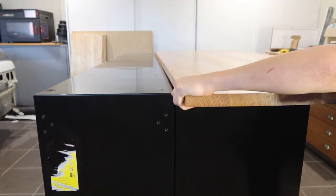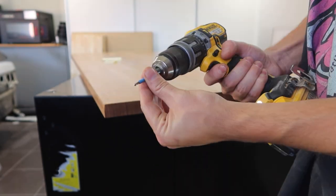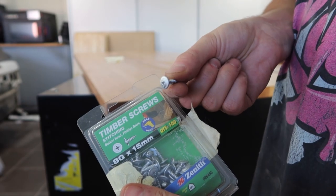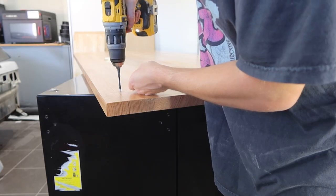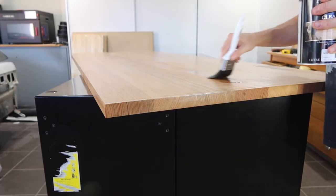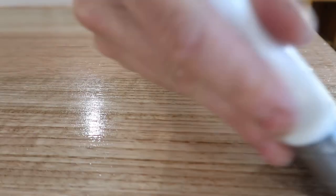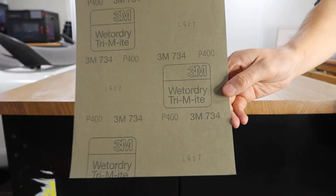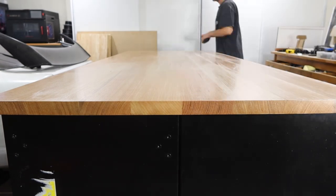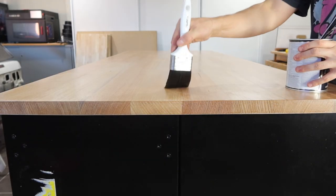Before the very final coat on the top I flipped it over to the underside and marked out where I was going to put all the screws. I decided I'd like to do nutserts as well like the original bench tops, but just to start I put some small pilot holes and small wood screws just to make sure the holes were in the right spot before over-committing to a large hole for the nutsert in the wrong spot. One final sand and coat of varnish for the underside, including the fresh screw holes, then flip it over finally to the top side for the final coat. Before that final coat I used 400 grit sandpaper to knock the top off — it did something but was probably a waste of time. I put the final coat on and let it set for a few days to harden up a bit.